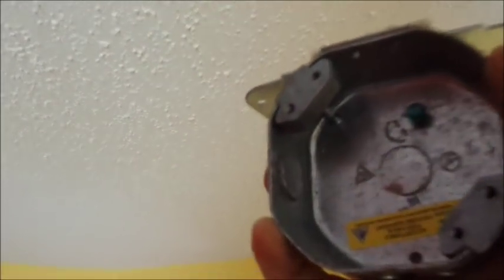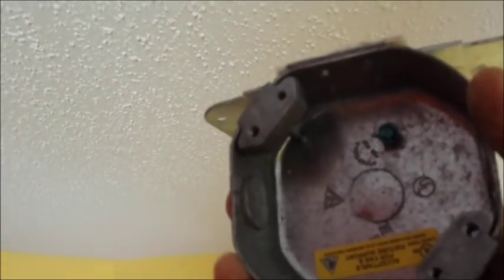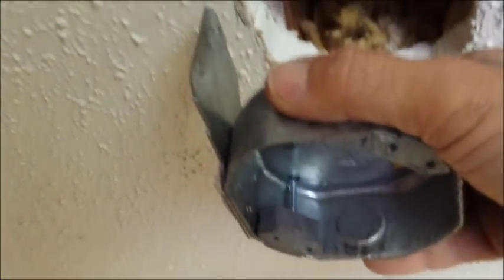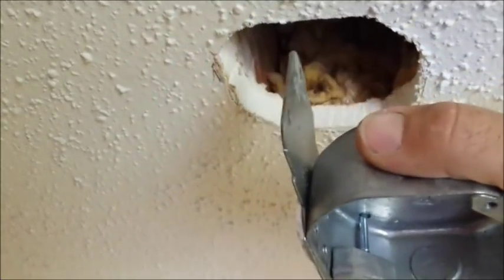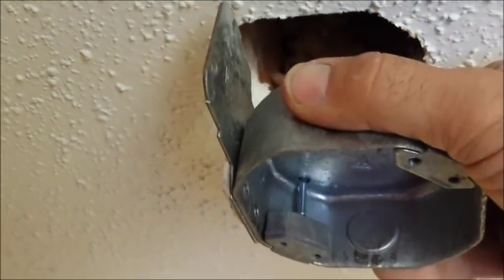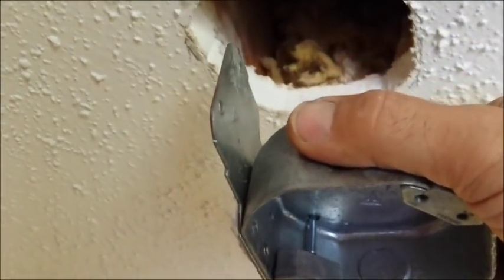We're going to use a fan box like this. This is an electrical box that's made for a fan to mount on. You can see it's got this heavier area where the screw goes into — it's got more threads and more metal for the threads to grab on. This box also has this mounting flange on the side. That's why I moved my hole over to the truss so that we can go up in the attic, drop this down through our hole and just screw it right to that truss and get it nice and strong.